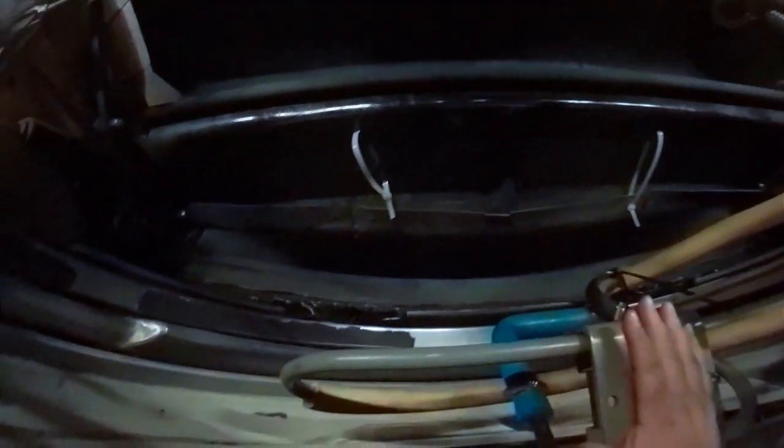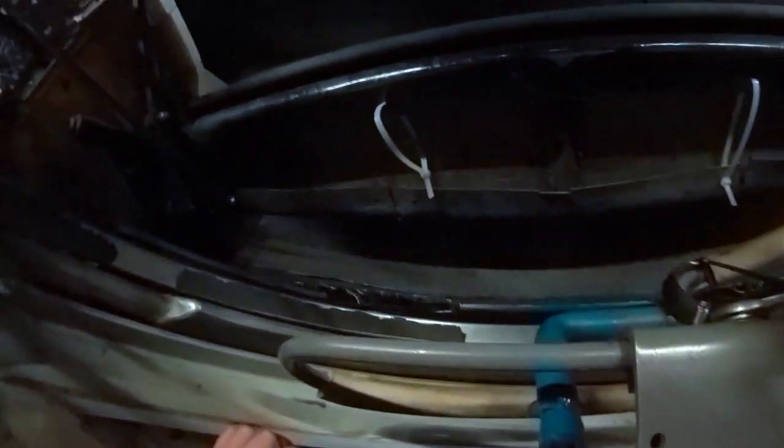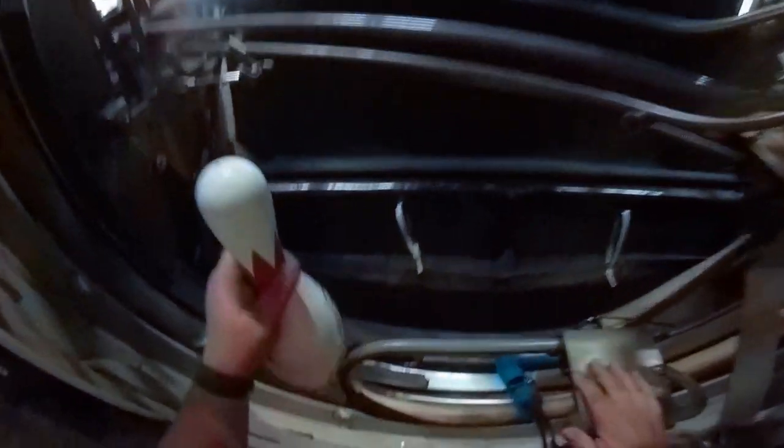We're back. Now, you can see this lane's obviously had ball issues because somebody has put kicker after kicker after kicker after kicker on here. They don't need all that. If a kicker's not doing it, you need to wipe your ball wheel or fix your adjustments. This is a waste of money. When the kicker gets worn down, you scrape it off, you replace it. Adding one after another like this is just throwing money out the hole. It's also why a whole lot of pins get kicked out, because the ball has no chance to pause between your kickers.